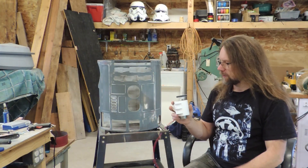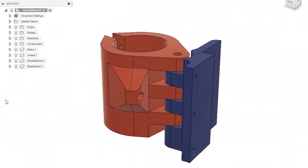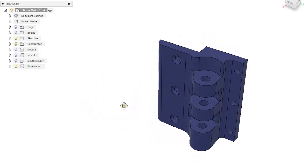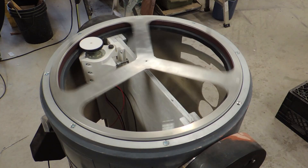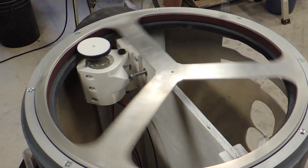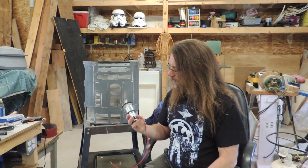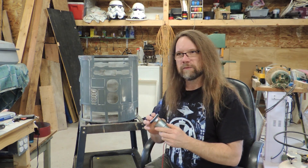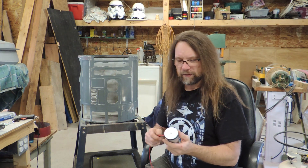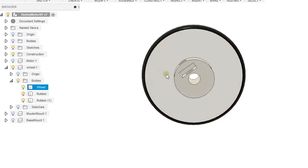The next piece of this puzzle was the motor and the mount for the dome rotation. Once more I modeled it in Fusion. It consists of a mounting bracket which attaches to the mainframe and a motor mount which clamps the motor firmly. This whole unit uses spring tension to make a friction drive pushing against the inside of the bearing. I chose to use a 12 volt motor from Globe Motors with a gearbox attached, which gives a final output of about 120 RPM at full speed. I then made a drive wheel with grooves for two rubber rings and a captured nut to hold it onto the motor shaft.